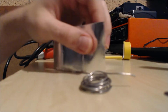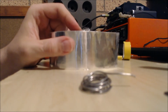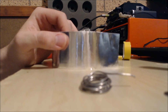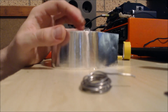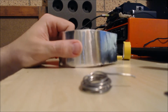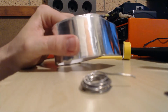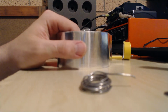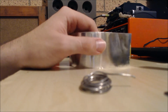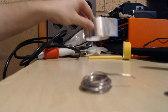And I'm using some aluminium tape. This is just to insulate the cavities to prevent hum, because Rickenbacker high gain pickups are single coil pickups, which are prone to that 60 cycle hum that you get from just being around any other electronics. And in this modern world, it helps to have some nice metal insulation in the cavity of your guitar, connected to ground, to absorb some of that interference, and basically ground it out of the circuit.